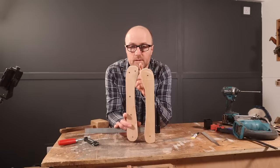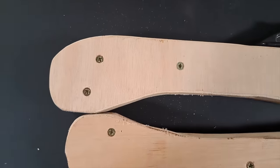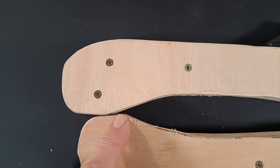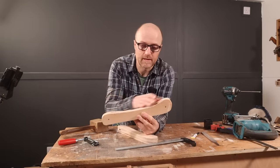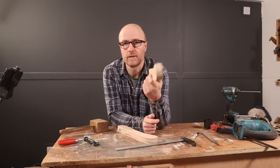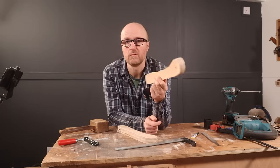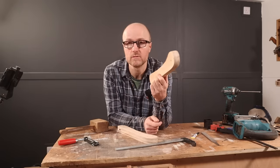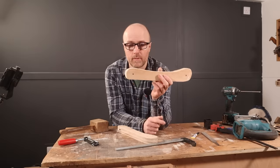There are a couple of minor points. We need to make sure that the angle the bar goes through when marking them up is the same on both jaws. An easy way to get around this: make it, screw it together, flush it all out, then take it back apart and use it as your template for every other piece — for the next three that you're going to make if you're making two sets. That will make sure everything aligns properly so the jaws are parallel on the bar.